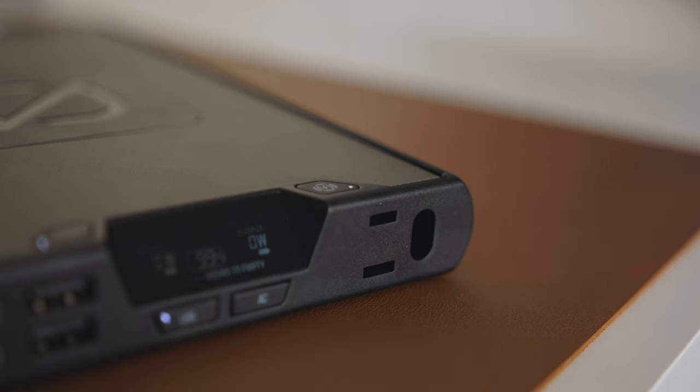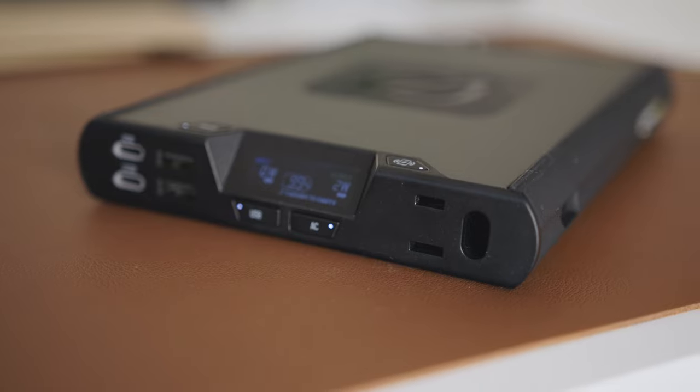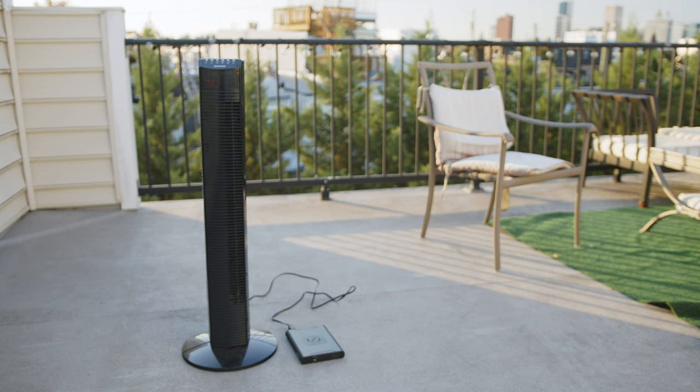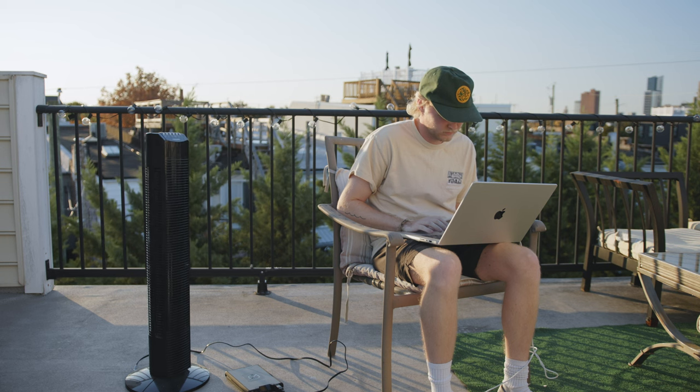So what might that specific scenario be? For me, I think it's in the name — it's the AC port. This is something that smaller lightweight batteries just don't have. This output maxes out at 100 watts, so you're not going to be able to plug anything into it and have it work. Big appliances that suck power for difficult tasks aren't going to be compatible with this battery. But for less intense, more sustained power draws, this battery can power a lot of household devices that you'd normally plug into a wall for multiple hours. I could see this being great for hanging string lights outdoors, a small outdoor TV, running a tower fan for a couple hours on a hot day, or even powering my big video softbox. Sustainable tasks outdoors where an outlet just isn't accessible — that seems like the best case for the Sherpa 100 AC.